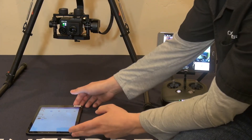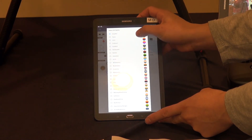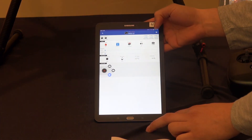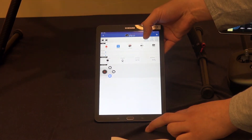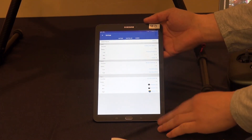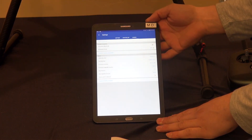You get a lot more camera control through the FLIR UAS app — more camera settings and control. You can see how much remaining space is on your SD card. It has a wide range of color palettes, way more than the XT camera. You can set outdoor or ambient temp, and select record, photo, or multi-photo. You can also see what your PWM settings are at. With this setup you only have control over the first two, so we set those to display mode and start/stop — but in the menu settings you could change those, for example to change your color palette. Walking through further, you've got more camera and video options, including 4K or 1080, and of course firmware and everything else about the camera.